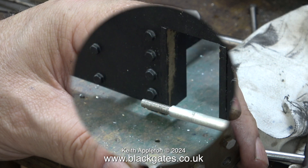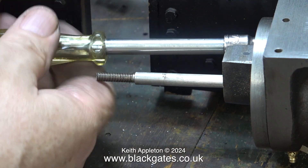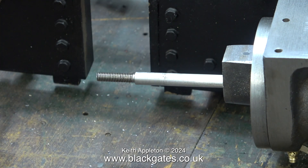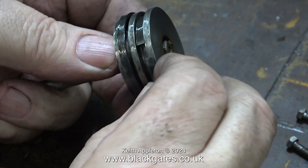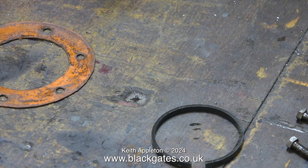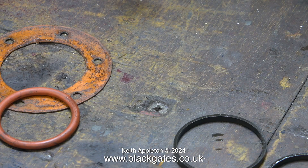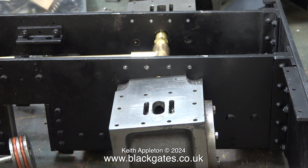Just as I was about to fit the crosshead to the piston rod I noticed that when I pulled the piston rod out it tightened up. Even though the cylinder bores are very smooth, this one has a slight taper on it. I removed the piston and also removed the piston rings. The piston rings fitted very well as far as the diameter was concerned, but the slots have been made slightly too wide — supposed to be one eighth of an inch but they're one eighth and a bit — which is actually perfect for silicone O-rings. I may be wrong, but was this piston actually made to use silicone O-rings? I'll never know.